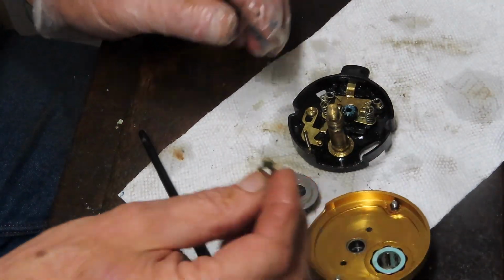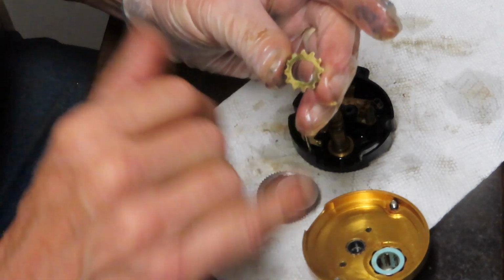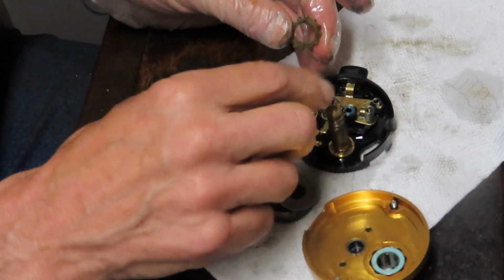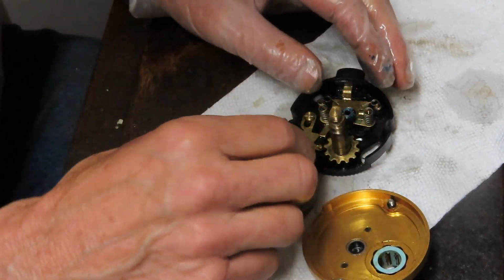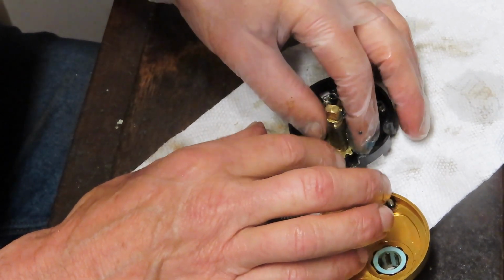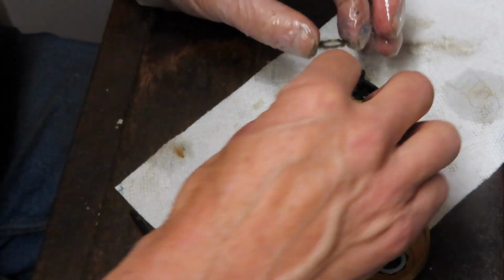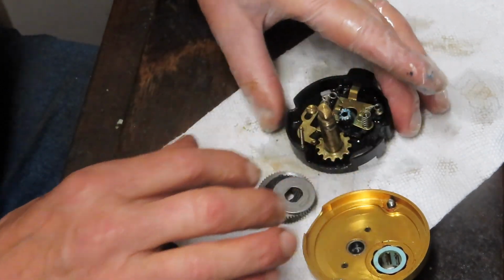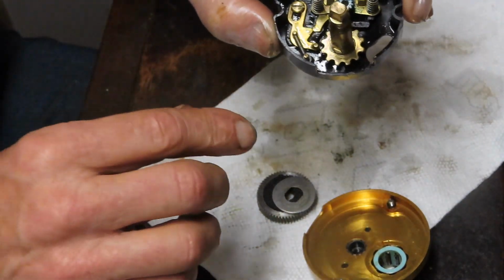Okay, now we have that little tooth gear, which is going to kick the pin out on that free spool release. Notice that it's not round and it's not rectangular. You have two sides that are rounded and two flat sides. And if you look on your gear shaft here, you're going to find that there's a way that that's going to seat where it's going to be flush. A lot of times I'll get this reel in and somebody will say, I just can't engage my drag washers. And then you go and you find out that the little click ratchet here has not been seated properly, and that's seated properly. You can see that now. You're flush here and you're not rising, it's not rocking.